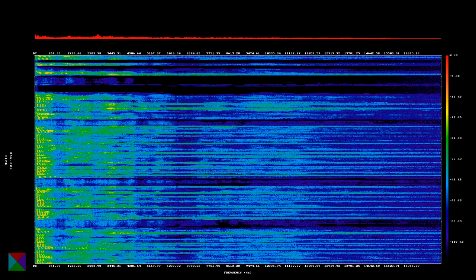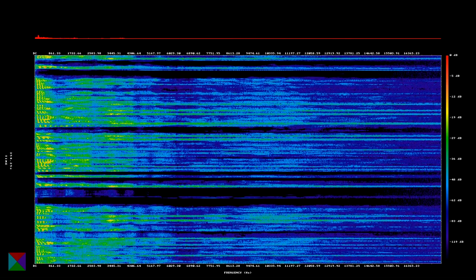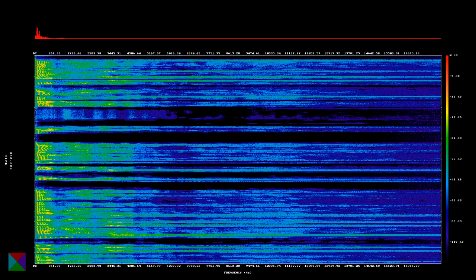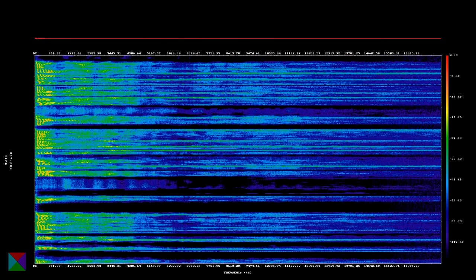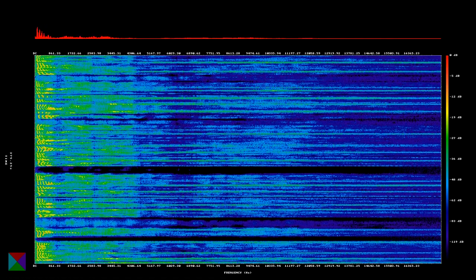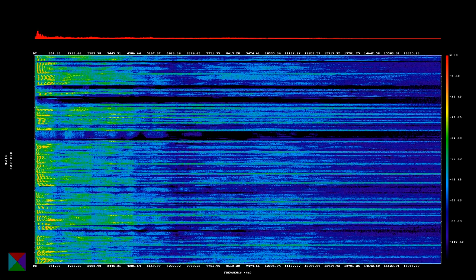So now let's pretend that I have a calibrated oscilloscope, calibrated within 1 dB. I plug in my beacon and measure. I'll end up with a reading that's plus or minus 1 dB of reality. In my case, perhaps I read 22.5 dBm. That means it could be as low as 21.5 dBm, or as high as 23.5 dBm — or between 141 and 224 milliwatts. So it's within specifications. Great. But I don't actually know what the actual output power is.